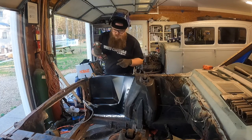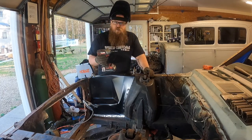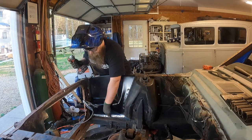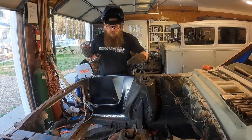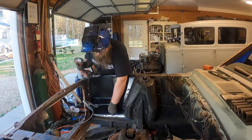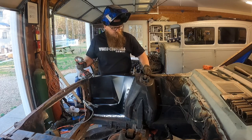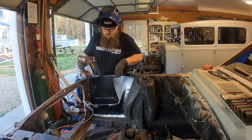Here's something some people are going to be afraid to tell you: don't be afraid to use self-tappers. My bottom piece is flared out a little bit, and to get a better handle on it I'm actually going to self-tap it into the steel. It's going to pull it in and I can spot weld around the self-tapper, making it a lot easier on myself.